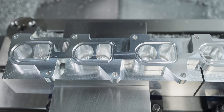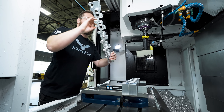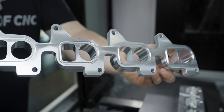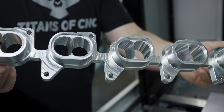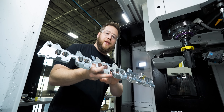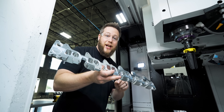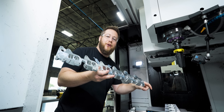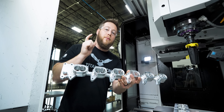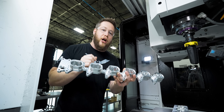This thing's looking really nice. The pockets blended really well — I'm not feeling any step in here and all the blends look great. I'm really pleased with that. I think this is a pretty good process, at least for these five parts. Obviously we'd do this differently in full production, but this is going to work out really nice. I've got a few more of these to run and then I'll probably send them down to Nolan so he can get them welded up now that all the intake parts are done. The next one we're going to do is the exhaust flange, and that one is 304 stainless — make sure you check out that video because we're going to do it on the X9 and see how it handles stainless steel. Hope you enjoyed this video — let me know in the comments if you like this style where we take you through the full process. Hit that like button and subscribe because you don't want to miss the next one.